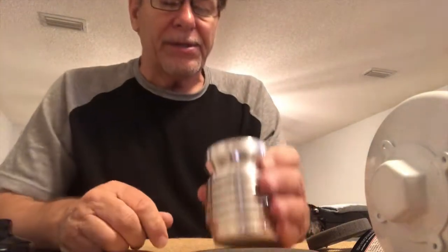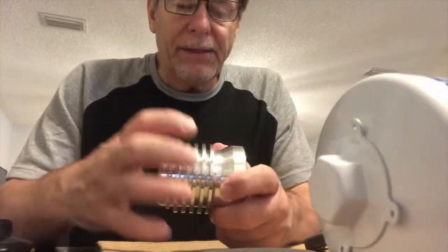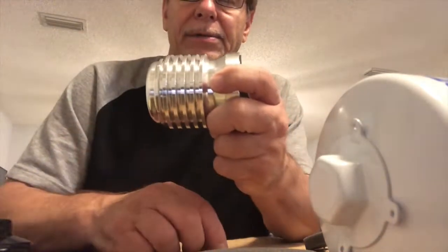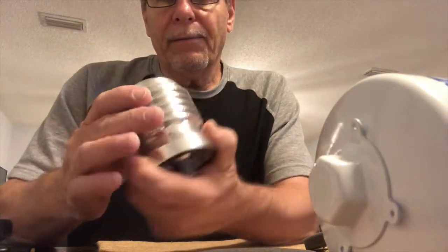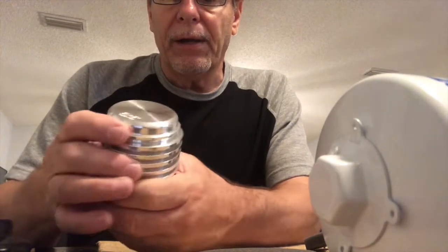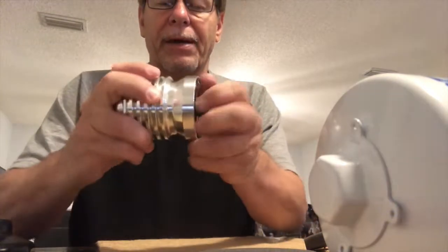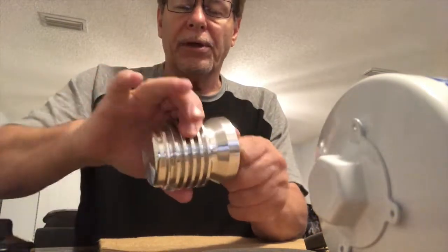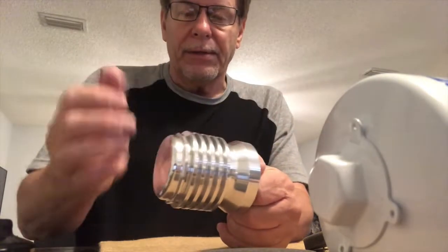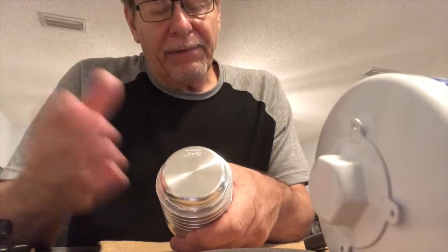This is supposed to be the right one — I think it's an S15. These little fins are heat sinks, supposed to assist with oil cooling. One thing you notice is it doesn't have any holes for safety wire. Two ways to solve that: one is to put a hose clamp on it once mounted to the engine, in a position so you can run a safety wire around the hose clamp and tie it off.